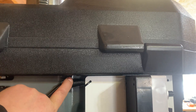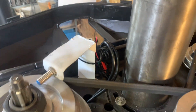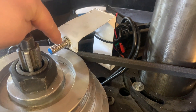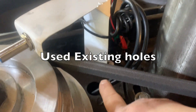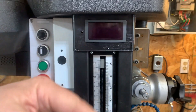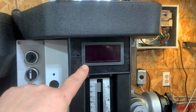On the mill side, here's the box with a wire coming all the way up into the pulley cover — really simple. This is a two-wire cable. Inside the cover I've got my power cable coming up through that hole. We need four additional wires to power and send the signal from the sensor to the tachometer. I routed these two cables into this housing because it's wide open with no moving parts, so you can bring your cables up here, get it all wired up, and put your tachometer right in place.